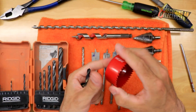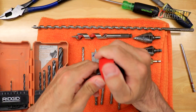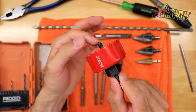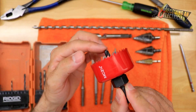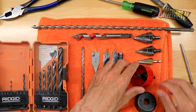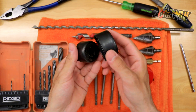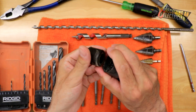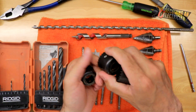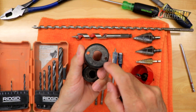Sometimes you can just keep pulling the trigger on the drill and the material will come out. The hole saw slides on and then you tighten down the nut — then it's good to go on your drill. You find your center point and work your way in. There are also cheaper hole saw sets; in the smaller sizes there are no pin holes, but once you get into the bigger sizes the two pin holes appear.